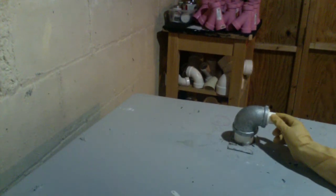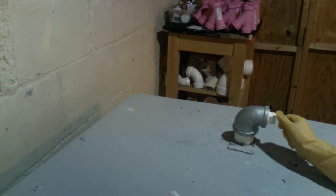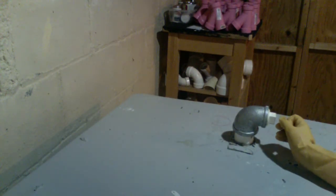What we're going to do is cut the tip off the head, and then after that we will tediously cut four slots, and we will pry those pieces out without scratching the hub, and then we will screw in our new plug. So let's cut the head off first.